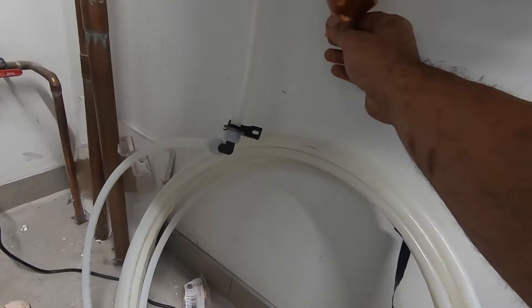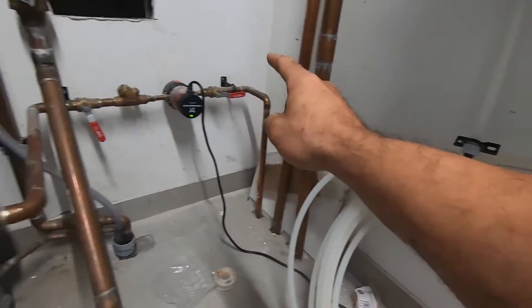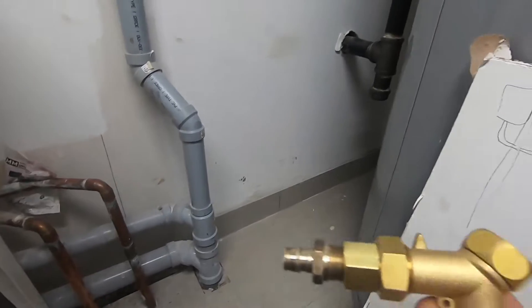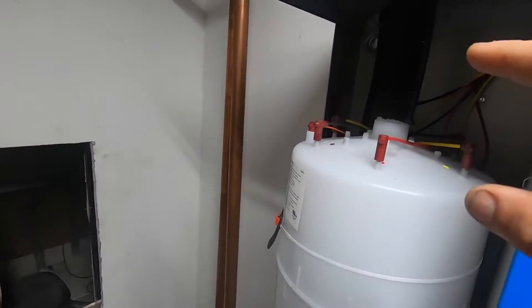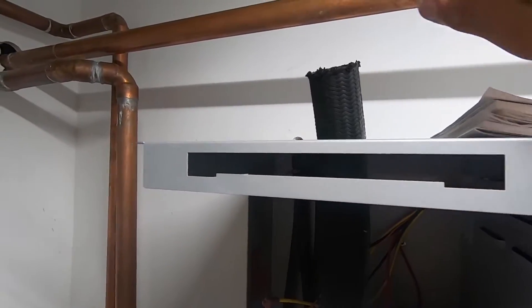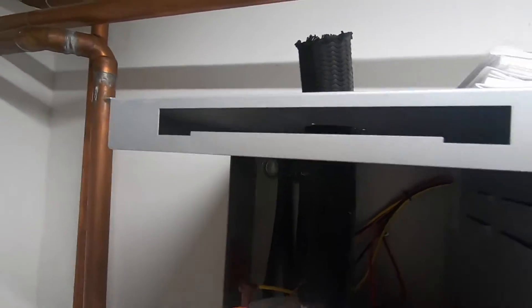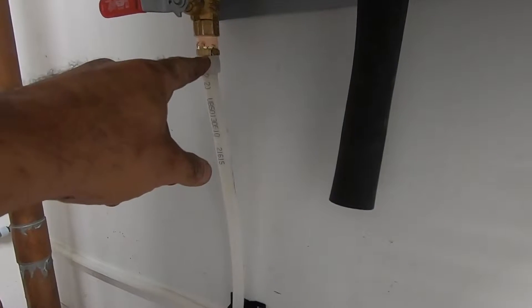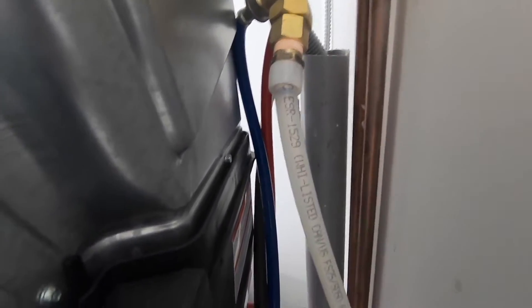So it's going to be like this — trap to drain. This is my water feed: I'm going to come across, behind here, and hook up with this to the washer machine for my feed. My steam — I'm going to be putting it to here and that's going to the power pack as well. You want a decline on this pipe too — it's producing steam, goes in there, and then the condensate, the 3/8's, is coming out. I have a PEX adapter, elbow, across, and what I did is I put a Y on my washing machine and put another PEX adapter there. So right now we've got water inside there — we're good. It's all in series.